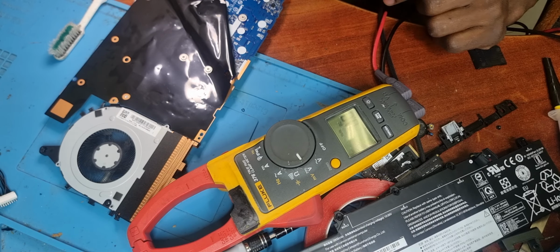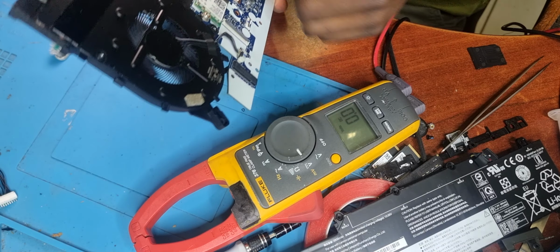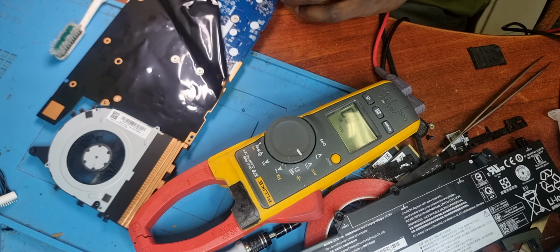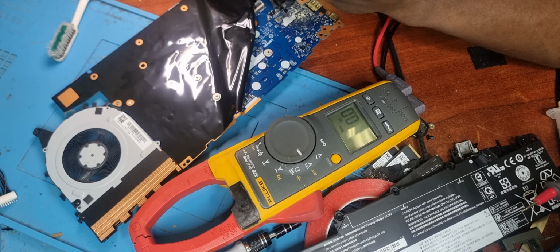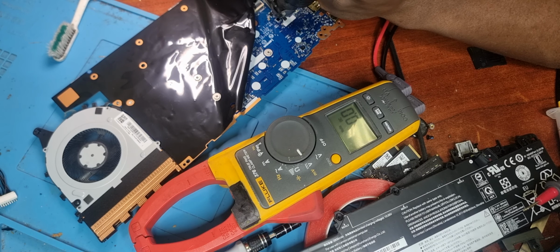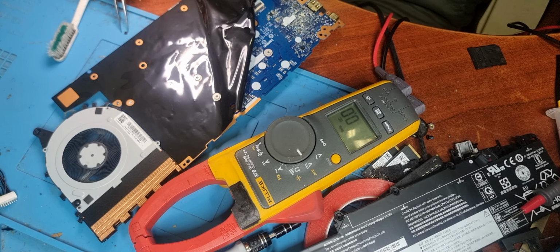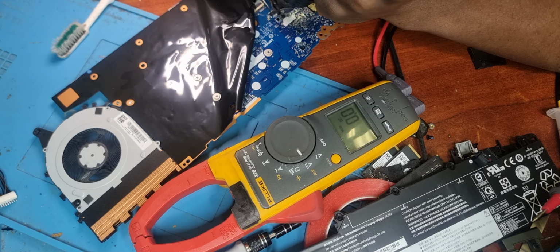And then when I take it off, it goes dead. I don't know about the fan, whether it works or not. But anyways, so that's the issue I'm facing here. MOSFET is not sitting properly or it's dead. Oh, there was a short between the gate and the source. There was a short over there.